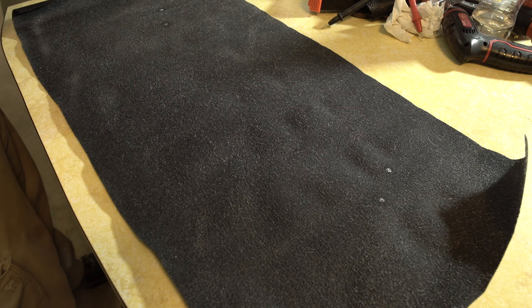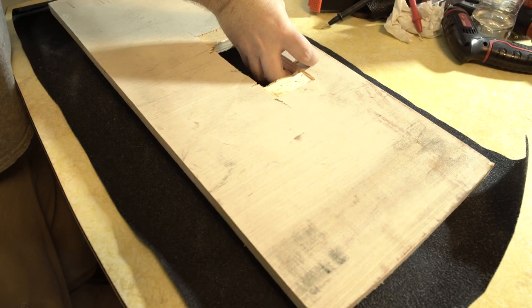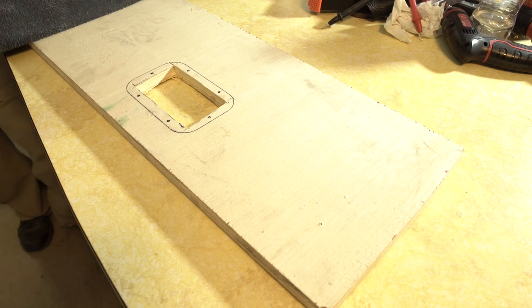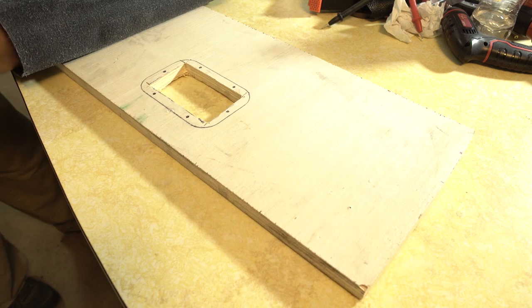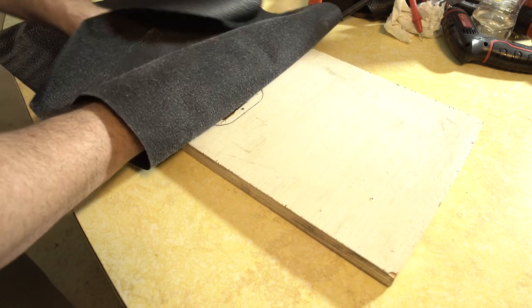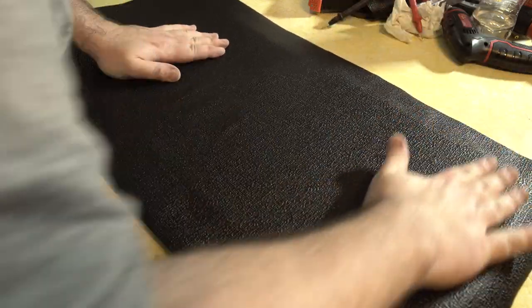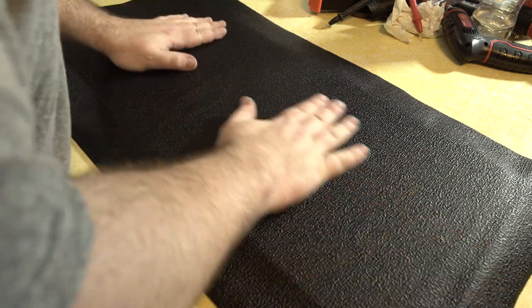Okay, our Tolex has had enough time to dry, I believe. You don't want it to be totally dry, but the point is leave it just slightly tacky enough so that these guys stick together and then they'll have a really good bond. Try to center it as best you can. Sometimes it is best to smooth out as you go. Lots of pressure. You can do this with a roller too. That'll be a way better result. Lots of pressure pulling that out.